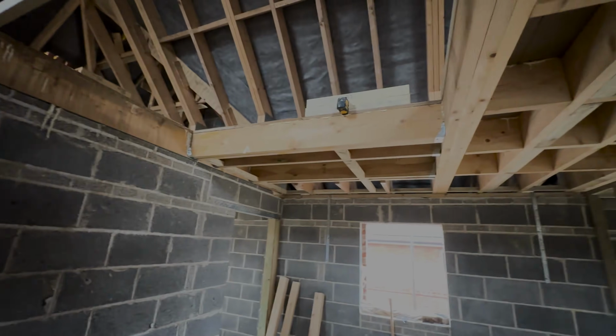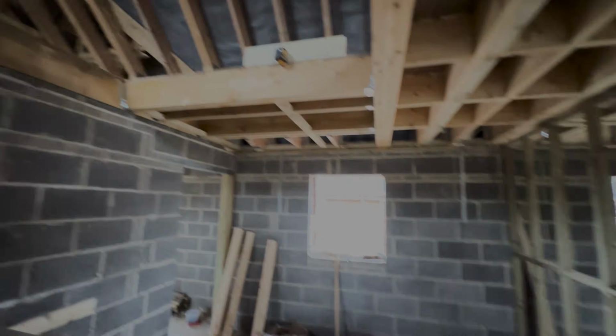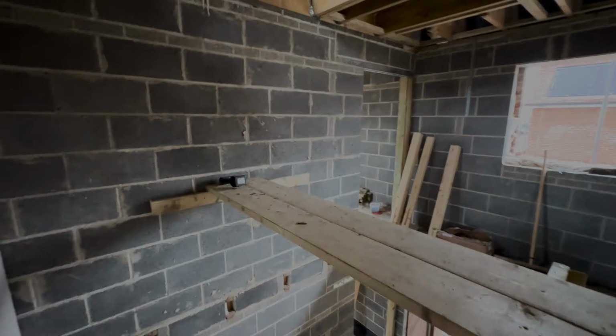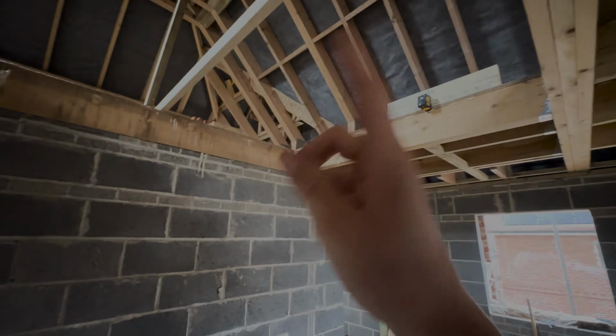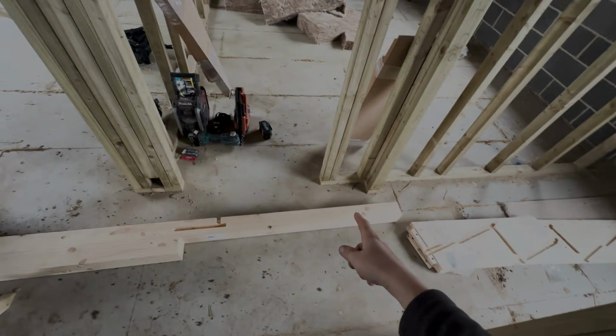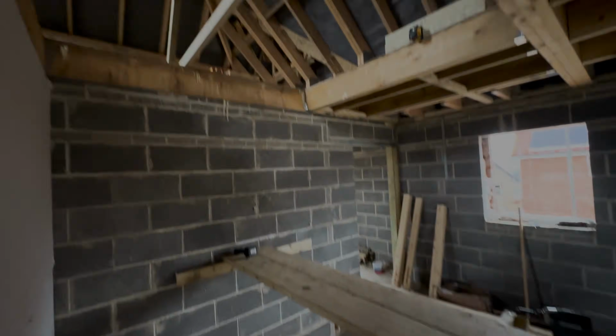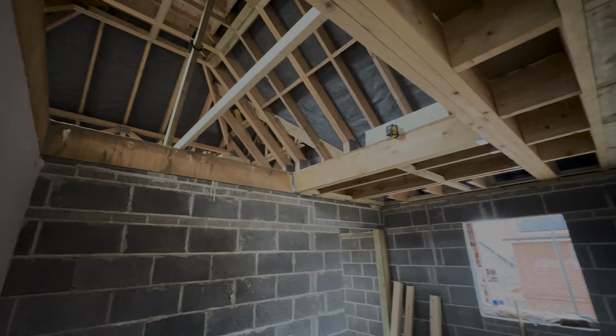I've also found the finished floor level around there and set the laser up, so we'll put this newel in, set the laser to hit the line for the finished floor, measure from the tread down, and then cut that off of the bottom here. And then I'll set up a time lapse again and you'll see us actually putting this up and measuring it, etc.